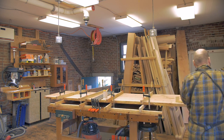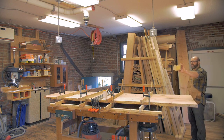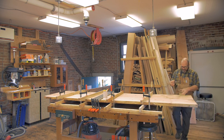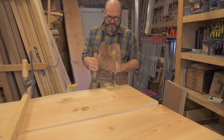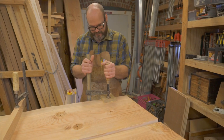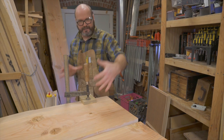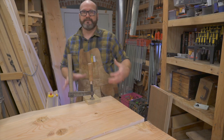What I'm going to do is take the side with this sticky back sandpaper — this 180 grit — and clamp this down really firmly. Now if I did not have that sandpaper there and I did this, once I start coming across with pressure, chances are these blocks would just slide and move and it wouldn't work. But the sticky back sandpaper's frictional coefficient is so high that even with a few hundred pounds of pressure, it's unlikely to move that block.